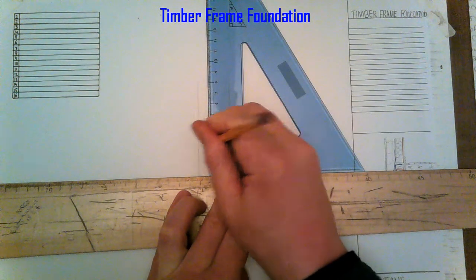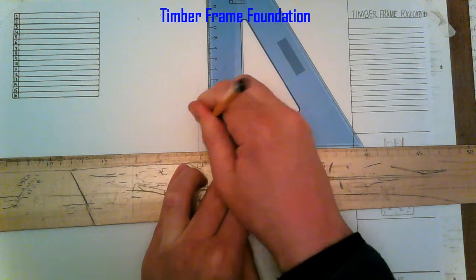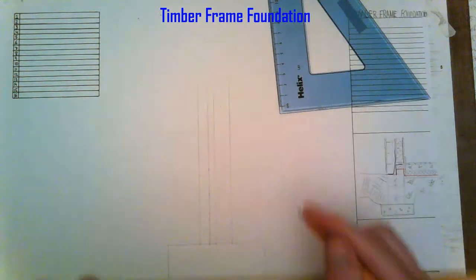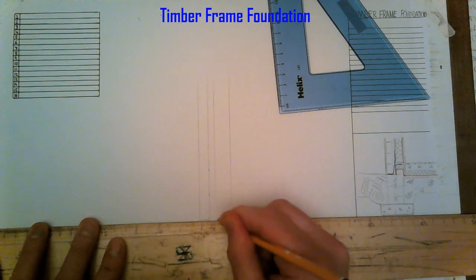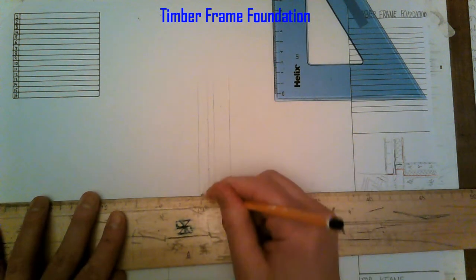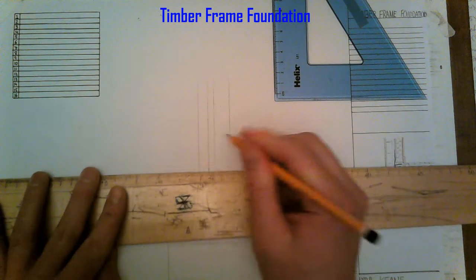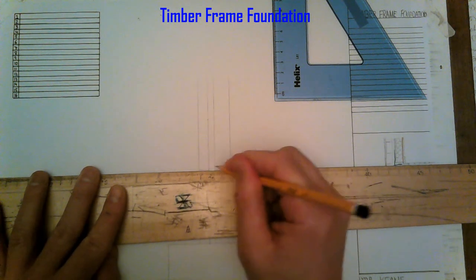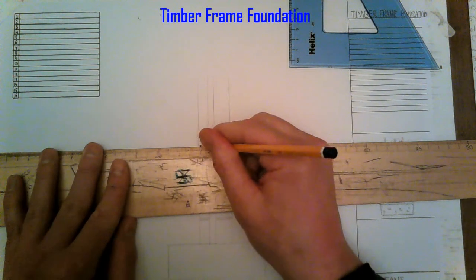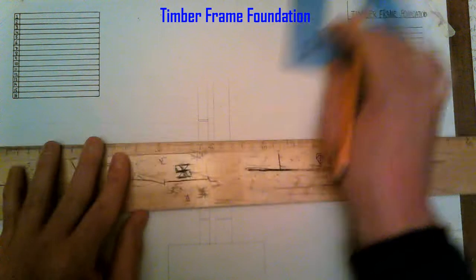Each block is 215mm with a 10mm cement bed between blocks. We're going to bring that across and up on the first four blocks on the inner leaf — those are concrete blocks. We have three full blocks on the inner leaf, then continue with the outer leaf.